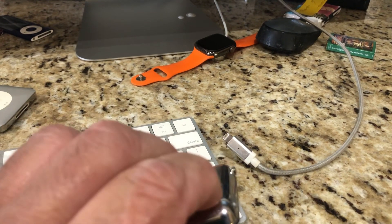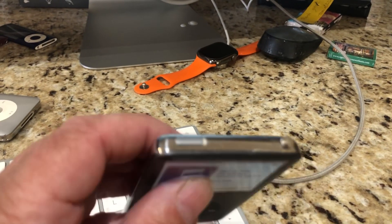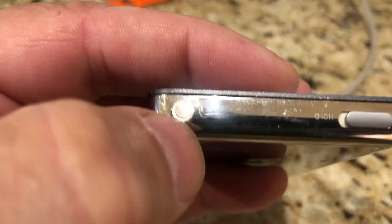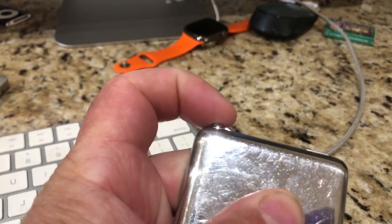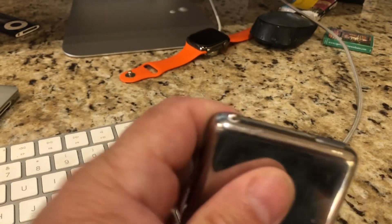I have to put a micro switch behind here, and the battery can move. I don't think long-term it's super reliable, so I'm switching to a switch. There's a small switch there that, if you press it, gives you tactile feedback and you can actually feel it click — that's a lot easier to enable pairing.